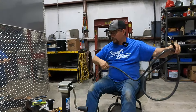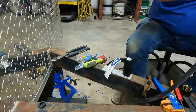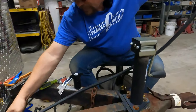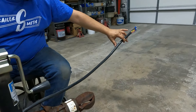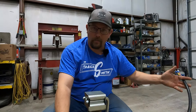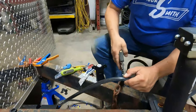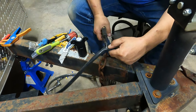I'm going to measure mine from my junction box. When I measure from the junction box, I'm going to measure from the backside because that's where the last wire will terminate — you don't want to measure from the front because it will be too short for the farthest wire. So I'm just going to mock it up. My cord is going to come like this — that is plenty long for me. I'm not using a weight distribution hitch so this will give me a little extra room. Not going to give a specific measurement because it's different for every unit and every setup — just give yourself a little extra and you'll be good. Let's cut this bad boy off and wire the plug on, then we'll switch angles and go into the junction box.